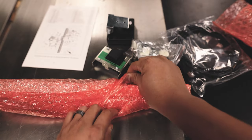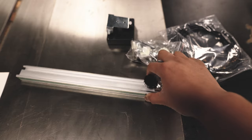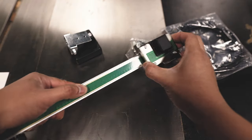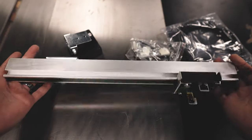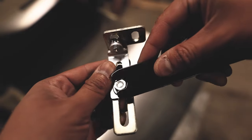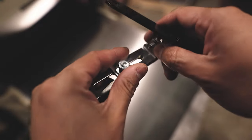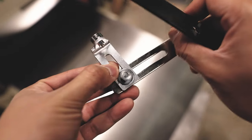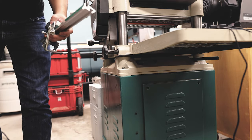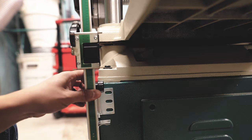When installing the sensor onto the scale, you want to pay attention to the arrow and plus sign located on the sensor. Make sure you're looking at your owner's manual to see what orientation this needs to be in when you install it on your planer. The cell bracket will be installed onto the planer, and on the bracket is a small magnet that will connect to your sensor. For my machine, I'm using figure 2 in the owner's manual, which has the arrows pointing down on the sensor and the magnet connecting to the top of the sensor.